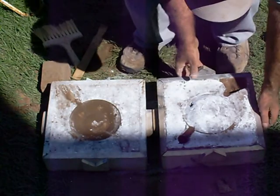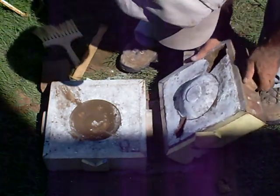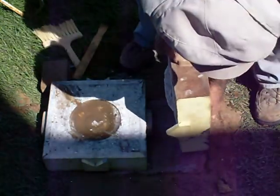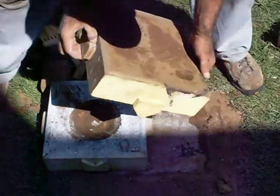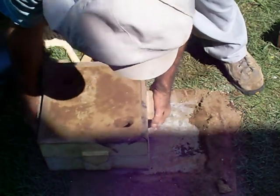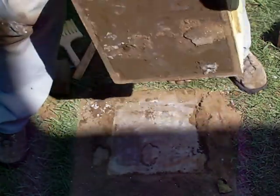And now you've got a void where your ceramic saucer was. I've got these color-coded purposely, so I'll stuff up — and then voila. The sand is pretty stiff, nothing wrong with it. There you go: the bottom side, the top side, the bottom side.